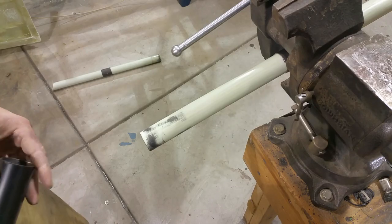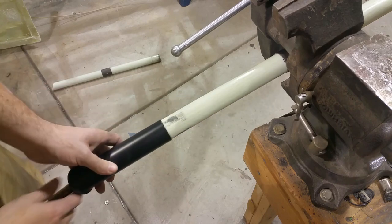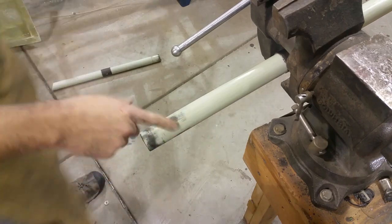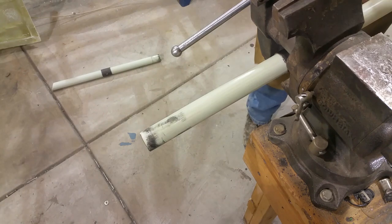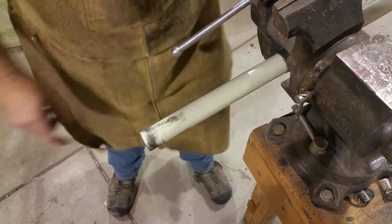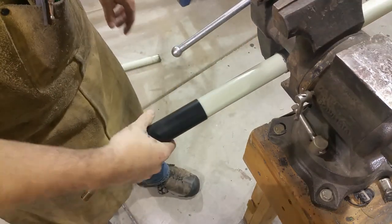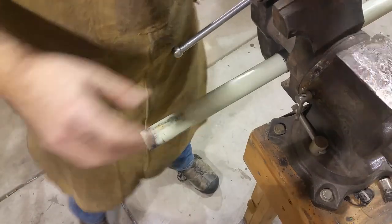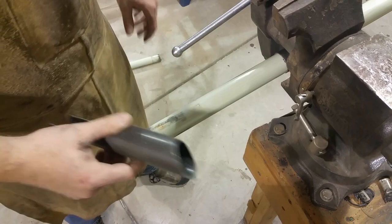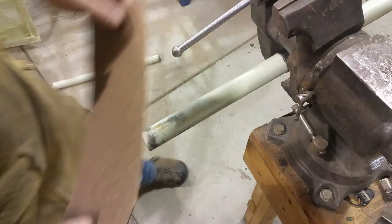And it's just a matter of close tolerance, hard fit. I mean, this is the axle that comes with it. It can fit on that side, I've cleaned it up, but if I go to this other side, I can't get it on there. So it's a few thou too big. I've got this one now, so it slides on. This doesn't go on this side, but just for demonstration. This is the tube that I used, by the way.